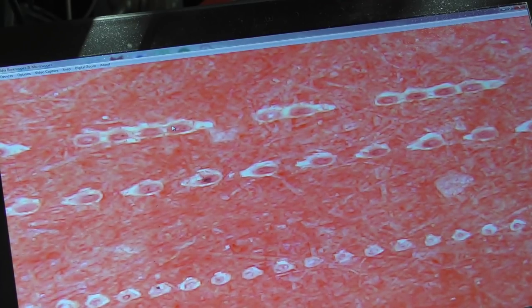And I think that's all because it's already sitting there at the top of the pre-ionization zone, ready to switch the beam on at the instant that the electronics tells it to. There is no electronic delay. So there's no physics involved with this in the same way that there is physics involved with switching on and off a glass tube through the power supply. So this is all good news, because it does mean to say we can now progress further knowing that we understand exactly how the PWM works on this machine.